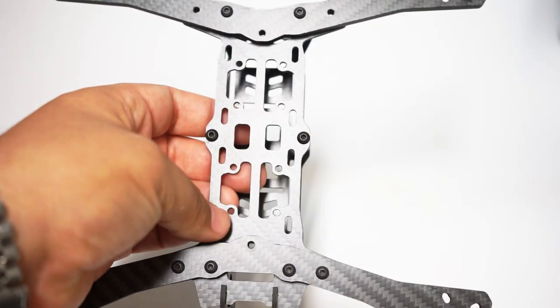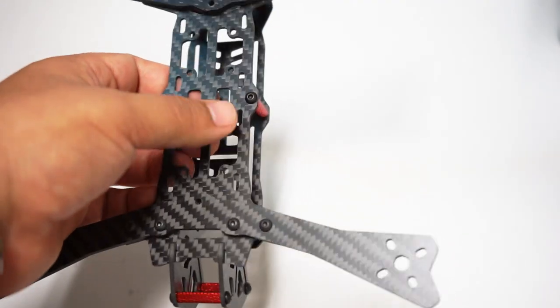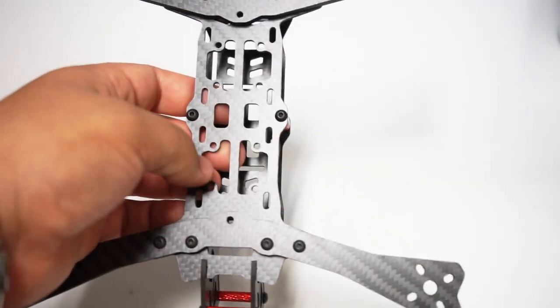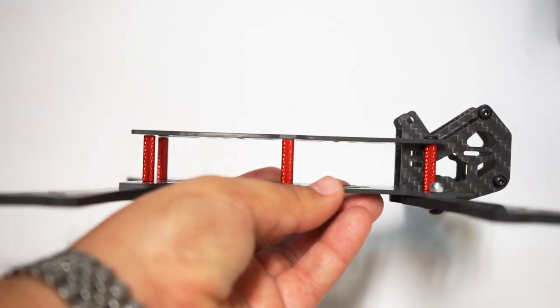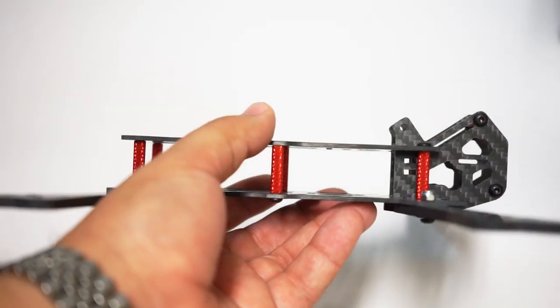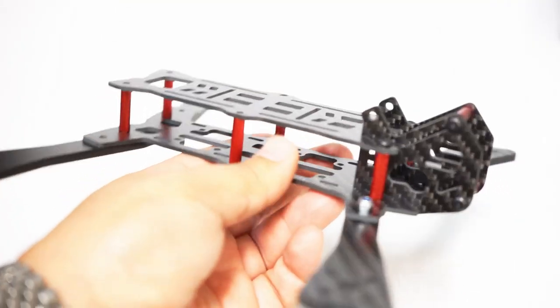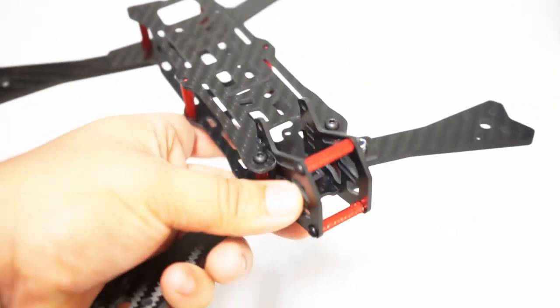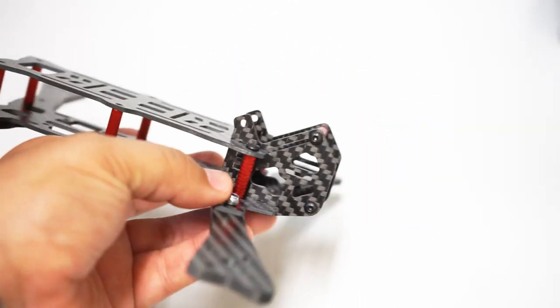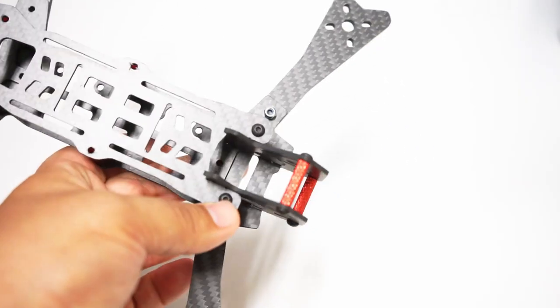You have the same set of mounting holes — mounting holes in the back and at the front. The sizing gives you some 30x30 slots which allow you to move things a little bit forward or back, and a 20x20 in the middle, and that's repeated exactly in the rear so you can layer your electronics side to side. It's a thin deck, so you're going to want to layer electronics side to side. Great camera protection once again by Airblade — it goes together with three sets of standoffs and the front cage portion fits on exactly like the three-inch version.